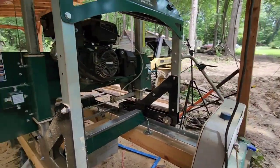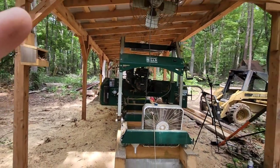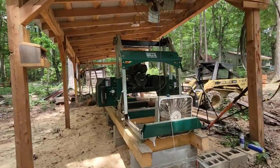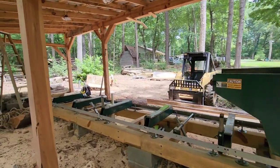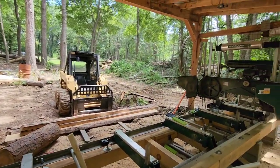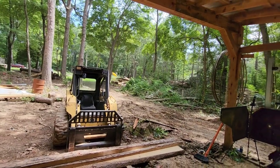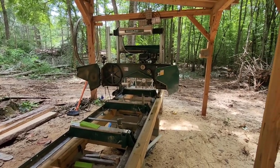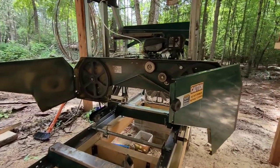This is a great mill — I can't say that enough. For the hobbyist or somebody doing it yourself — if you follow my channel, you've seen the shed that I built. It is a 32 by 16. When I ordered my mill I went ahead and ordered the extra extension so I could mill 16 and a half foot lumber, and a 10-pack of blades. I've yet to use all my blades — I've used half. The blades do good. The thing you've got to remember is if you keep the adjustments right and your blade sharp, this mill cuts excellent.